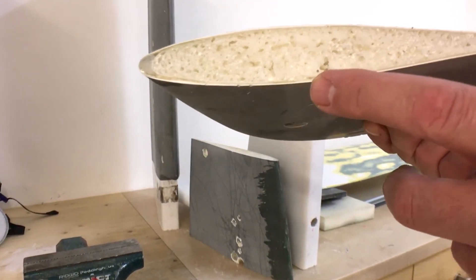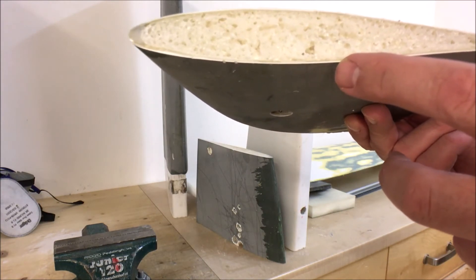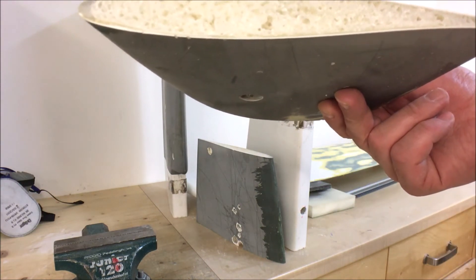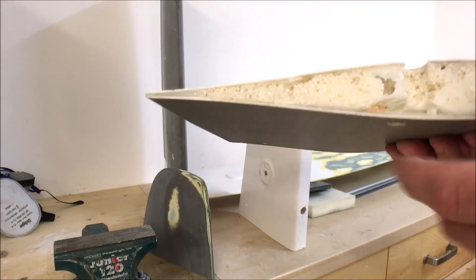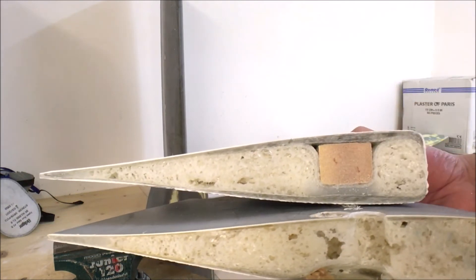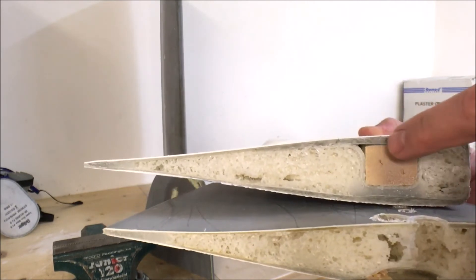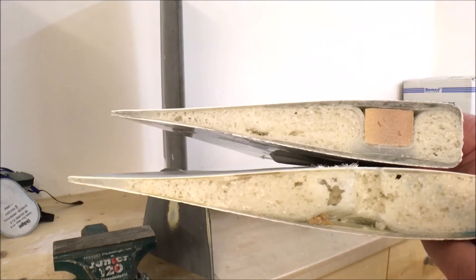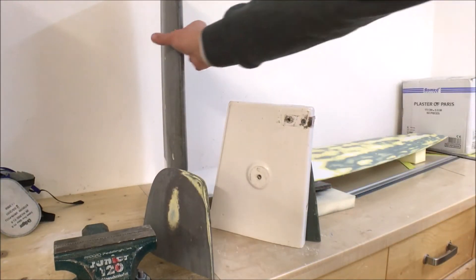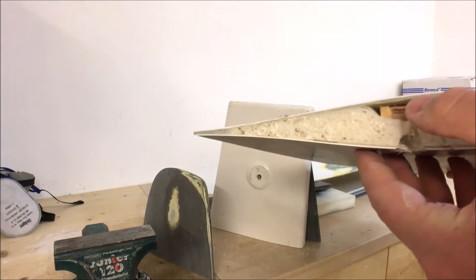There is a maximum of 1.5 millimeters. The gel coat — you can see it in white — has approximately the same thickness as the glass fiber laminate itself, which is amazing. It's so thinly laminated. Here at the end you can see the brownish structural epoxy foam block. There is a pocket inside, and at the top — the head of the rudder — it is quite thick laminated, where obviously the biggest pressure and tension act. But the rest of the rudder is really pretty fragile, going down to about 1.5 to 2 millimeters.